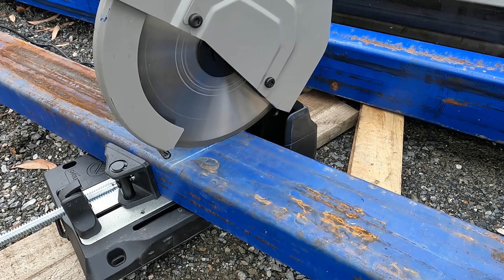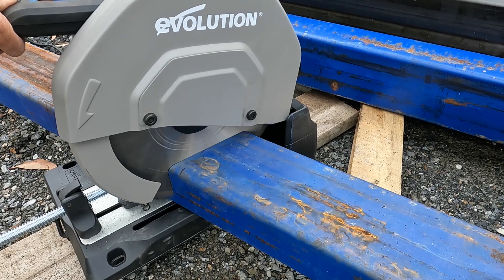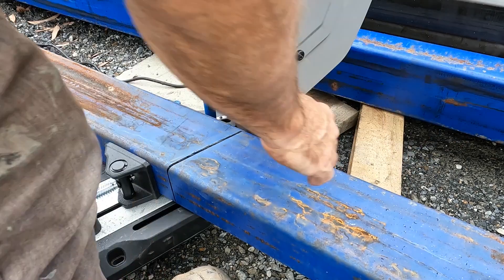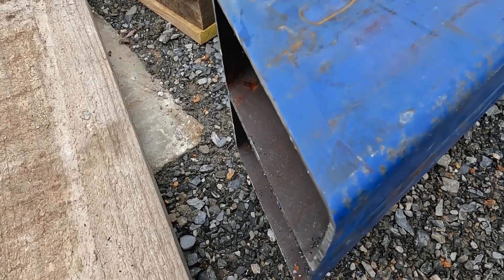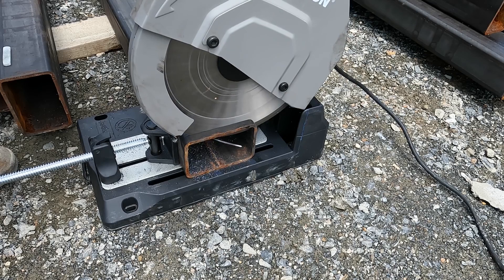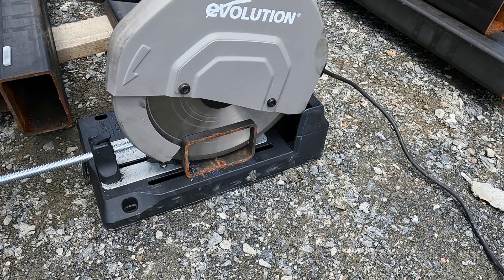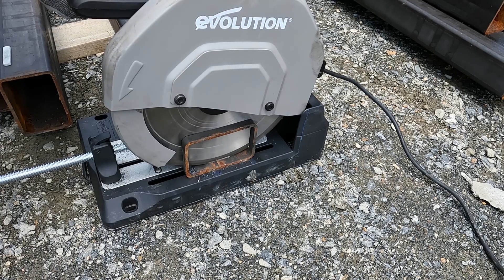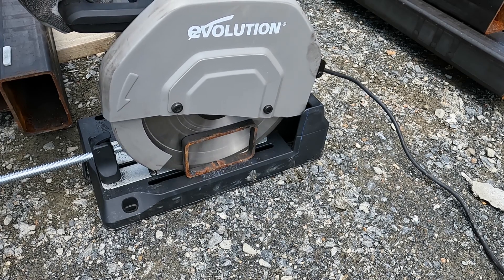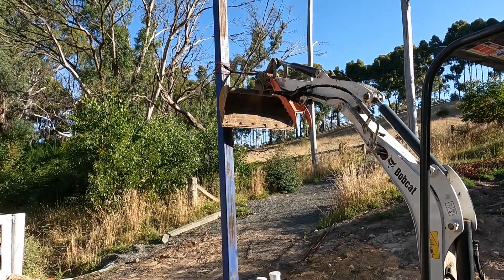Well done Evolution on a great saw — I'm not sponsored, I have nothing to do with Evolution. Second test: 20 degrees for matching the roof pitch — no problem. Then I put it to a harder test with 150 by 100 by 6mm for the columns that support my lifting beam — pushing the limits of the system — and again, no problem. The thing I like most is just how straight it is. There are blades for stainless steel, mild steel, and aluminium. The saw came with the stainless blade so I bought a different blade to do this mild steel.